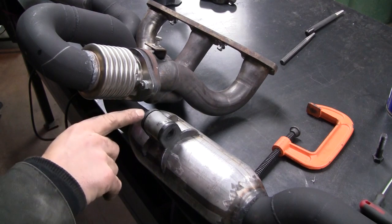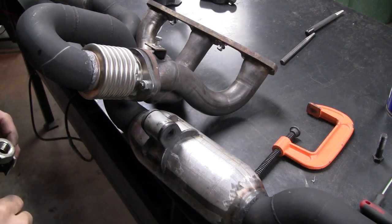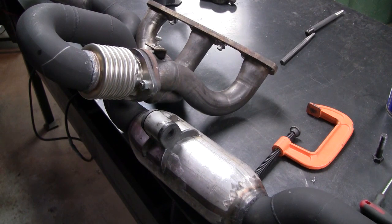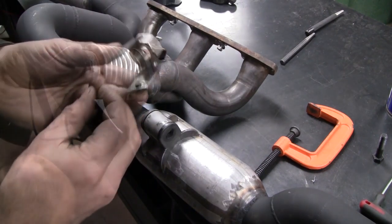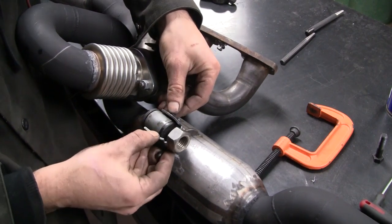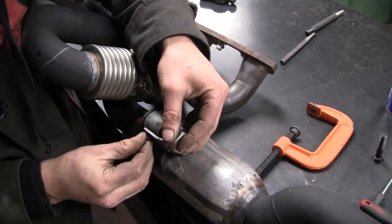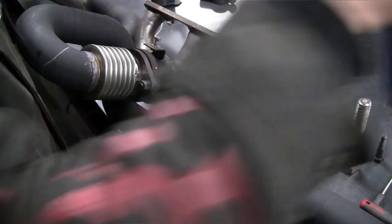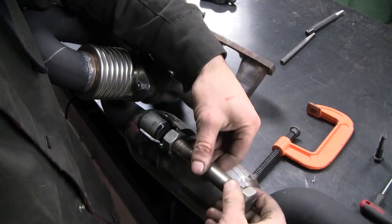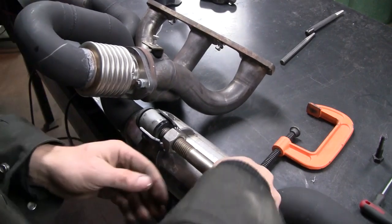Before I weld it though, I want to take the rubber bush out so that it doesn't melt when I weld it. When I took the rubber bush out before, I pressed it out in the press. No way it's going to fit now. So you may have spotted a couple of little threaded holes that have popped up. That was for this little bracket, which will hopefully screw on those threaded holes eventually. And I've already given it a quick hit up with some WD-40, and this giant bolt should hopefully push that bush out. Plan.